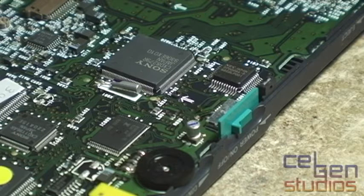This is problematic because they've all gone out of tolerance and electronic components don't work. Worse yet, because they're leaking, the electrolyte gets onto the board, starts eating at traces and vias and leaching into nearby ICs, causing all-out ruin and wrecking the board.